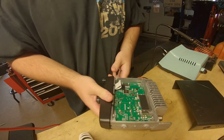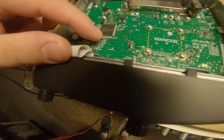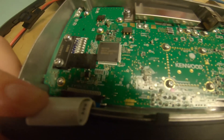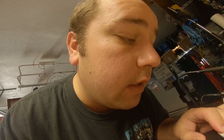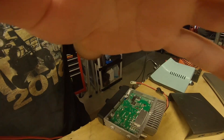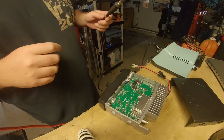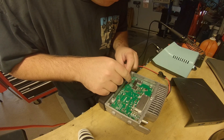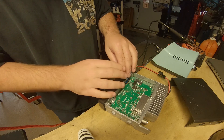To modify this you're going to go in here. Right here there's a series of four resistors — the camera doesn't pick it up too well with my light, but it is resistor R768 that we will be pulling out. To do that, some people just go ahead and break it off. I've got the soldering iron here — I'm going to heat up the solder that's currently on there and just pry off the little resistor.